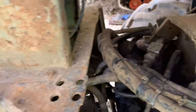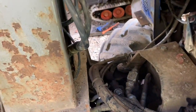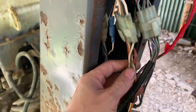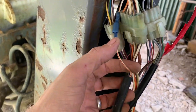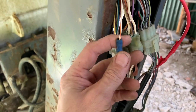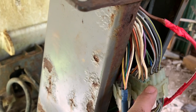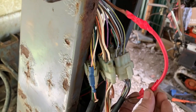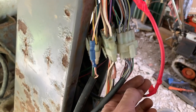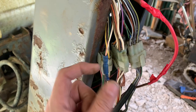Remember that orange and white wire inside that block? I can see from the cabling it goes around through here, hooks back underneath and up here - and lo and behold, I found out somebody else has been in here before me. Strangely, they've bypassed the orange and white - or more importantly, white with an orange. Interesting - maybe they were sniffing around the same problem. I've then discovered a really bad live here that I've bypassed myself with a bullet connector, because this connector is knackered - I've literally just hooked around it. So someone else did one before me, and I've done one now.